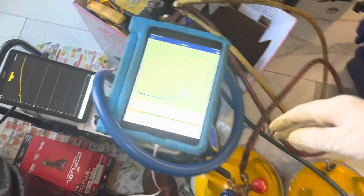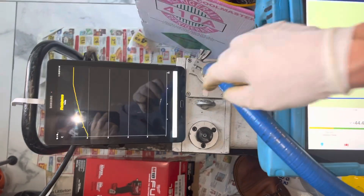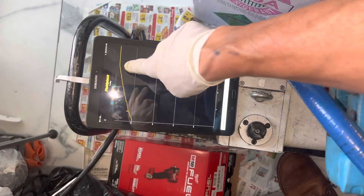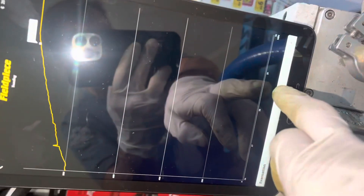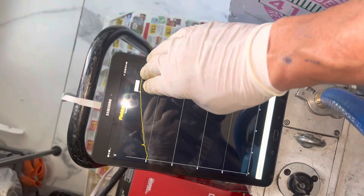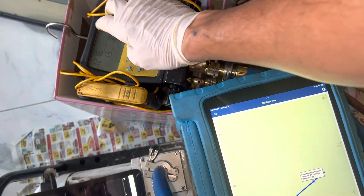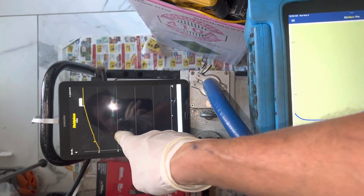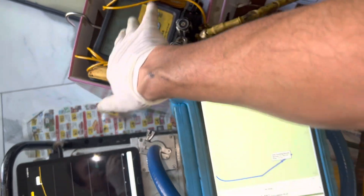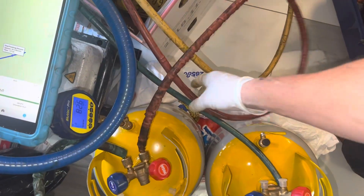We found our peak on the level-out — you can see it leveling out right there. I actually lost contact at 30 minutes, but you could see it was about 29 minutes going into 30 minutes when it started peaking and leveled out. This is the vacuum decay. The battery safety went off and it shut down, losing contact with my Android pad. We're now at 1218–1219 microns, steadying right there — that is the vacuum decay of the hoses, just the hoses by themselves.